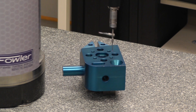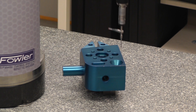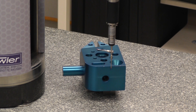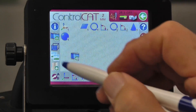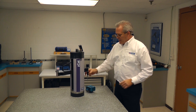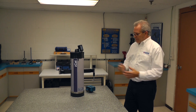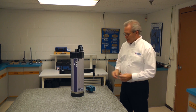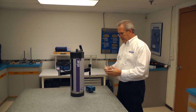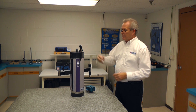It has a preset go-to speed and a preset measurement speed. Now it's measuring the plane, the line, and the point. I will then lock it into the Z-Cat, so now it knows where that part is. Now I can manually go in and measure any geometric measurement that you typically do with a coordinate measuring machine. If I've already measured some parts, I can actually string those dimensions together and create a program or a macro.